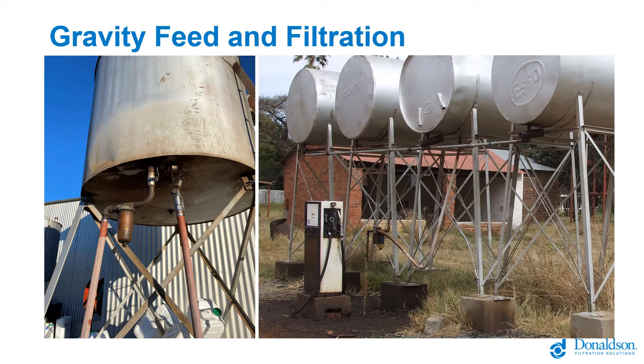You can tell by the way they look, these filters have been installed for a very long time and no one has serviced them. Lots of fuel has passed through them, but they have not plugged, which means the filter isn't collecting very much. We need to do significant cleaning of fuel to protect and guarantee long operation of onboard fuel filters on modern high-pressure common rail equipped engines.